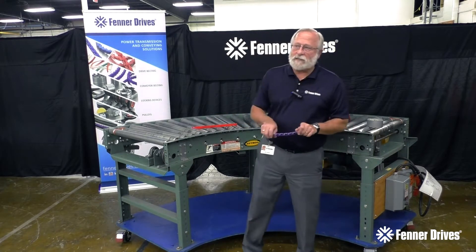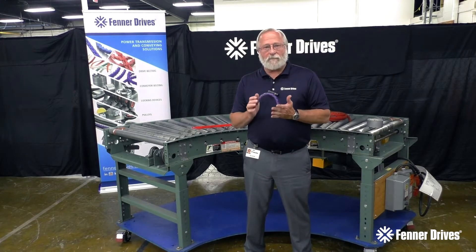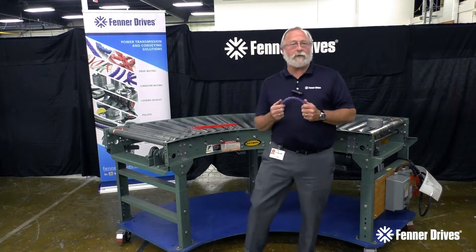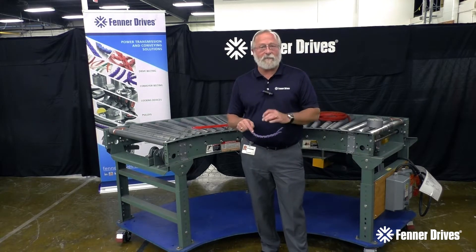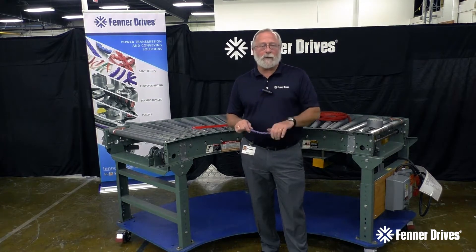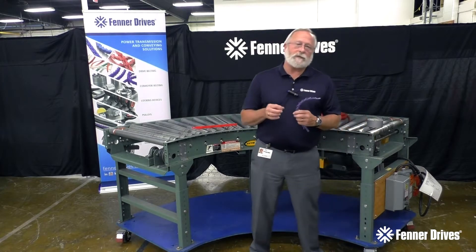The round rubber belts are 9-16 round rubber belts. We manufacture a Link V belt — this is a urethane material, fully supported. It's a drop-in replacement to the rubber belt that you're currently using. The advantage to this belt is that it comes open-ended in a 25-foot box. Number one, you're making the belt to length, so your inventory is reduced. Number two, it goes on open-ended, eliminating the need for disassembly of the rollers and the conveyor.